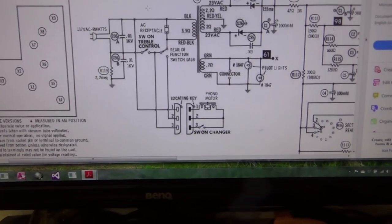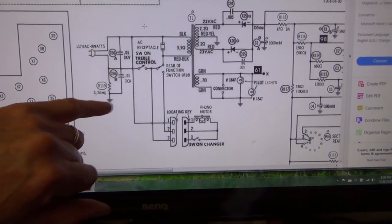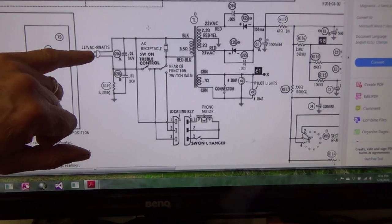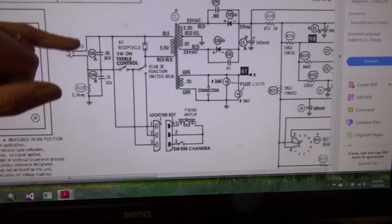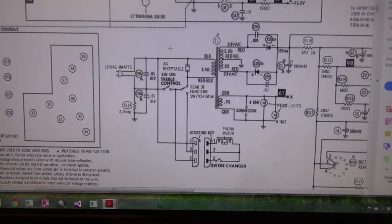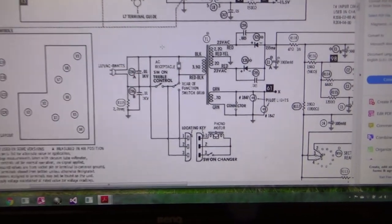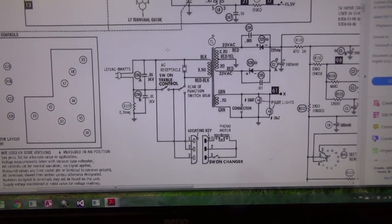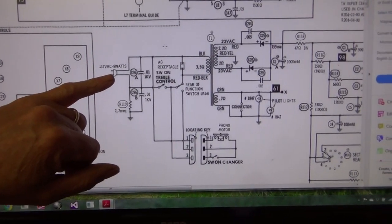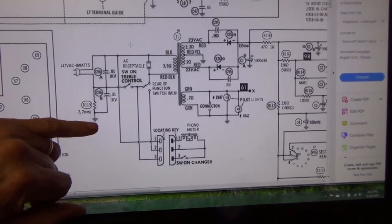I must have had it plugged in so that the power was coming through here onto the chassis. So I'm just going to put it polarized so that I make sure that the power is coming in. Like that. It's a little weird anyway, but I'm not going to mess with this. This is a ceramic cap, and the 2.2 meg is good. So I'm just going to put on a new cord and make sure that the common wire is coming down to ground.